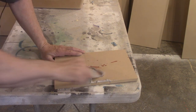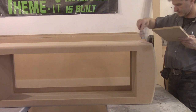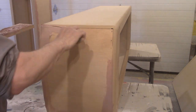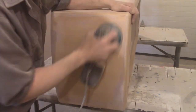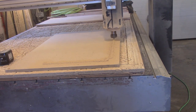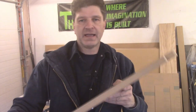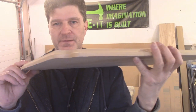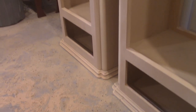I put some Carbondo here on this piece of wood and I'm going to mix it up. I really like using this stuff because it sands really nice, hardens really well, and it doesn't shrink. We're going to apply this all around the edges of our cabinet so that it will look like all one piece — just like a metal one would look. I didn't mix up a ton at a time because it hardens so quickly. We got our bases done — I machined them all out, and it looks quite similar to what they used back in the day. I routed a cove edge on the side of it; two pieces go together to bring it up a little bit and give it a nice base for our gas pump to sit on.